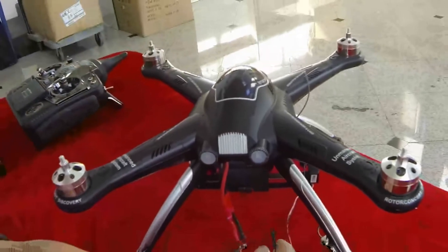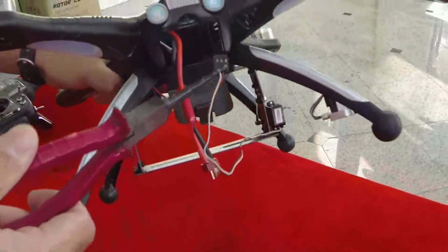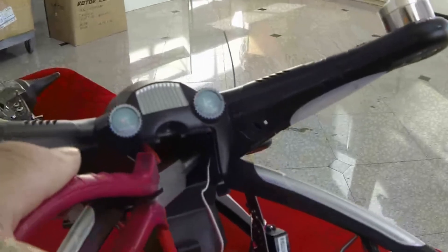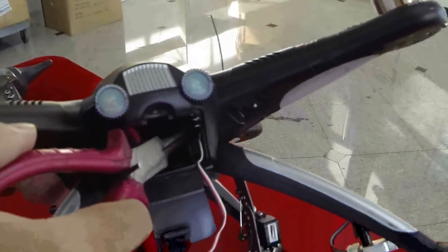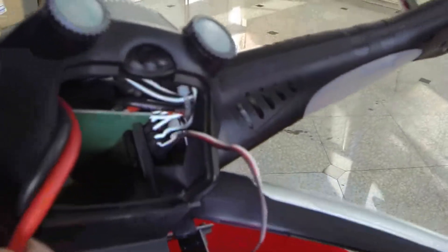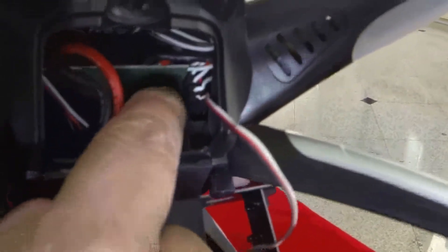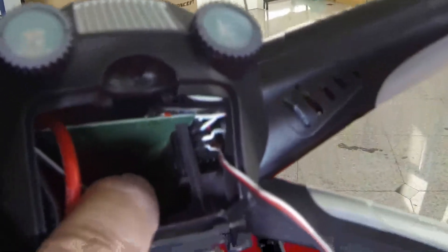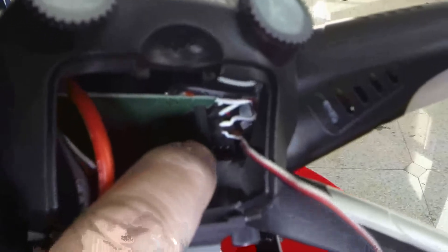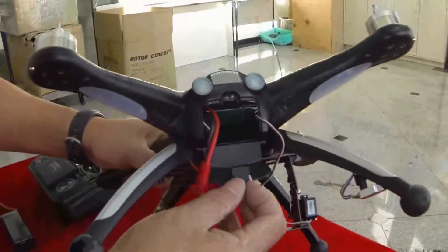Use needle nose pliers to grip the head of the wire connector, go in inside, brace against the other knobs, and then just push it in. That's it — it takes a little practice but it's pretty simple. The most bottom port on the receiver says BATT — that's the battery output, so leave that open. The next one is where you plug in your camera mount, which is called AUX2, so you plug it in there.